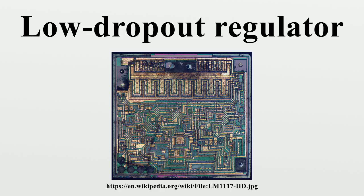Filtering. In addition to regulating voltage, LDOs can also be used as filters. This is especially useful when a system is using switches, which introduce a ripple in the output voltage occurring at the switching frequency. Left alone, this ripple has the potential to adversely affect the performance of oscillators, data converters, and RF systems being powered by the switcher. However, any power source, not just switches, can contain AC elements that may be undesirable for design.